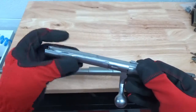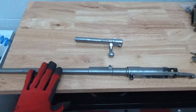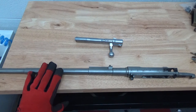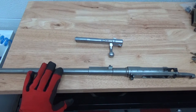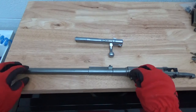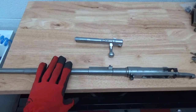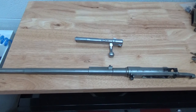It's going to look nice after we finish the rifle. We're going to prep this barrel with 120 aluminum oxide in the wet blast system, so we're going to mix the water and the 120-grit aluminum oxide together to get a nice anchor profile and degrease the part — a very fast, easy step. Then we can coat it. We're going to shoot a little bit of footage in the machine, then coat the part and be back in a few minutes, so stay tuned.